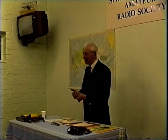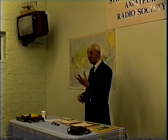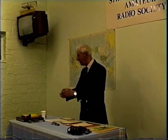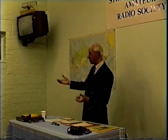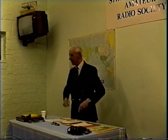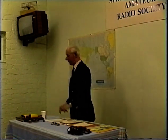We had plenty of aerial wire — beautiful 12-gauge wire — so I decided to make my antenna very simple. I put up a long wire at 66 feet, had another old capacitor, and made a parallel tuned circuit. But I had no coax to get down from the window. So I used the old trick I learned from Duke Harrower when I was 12 years old — you just use twisted pair. Two bits of wire twisted together: nearly 75 ohms. So I got two good quality pieces of insulated wire, twisted them, looped around it and up onto the little fitting.